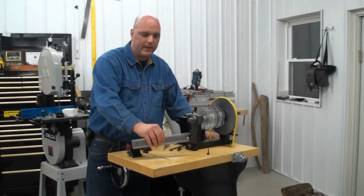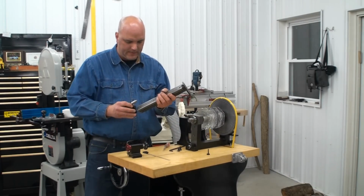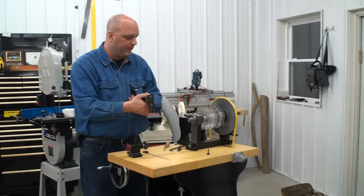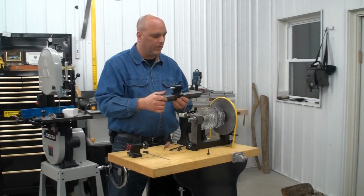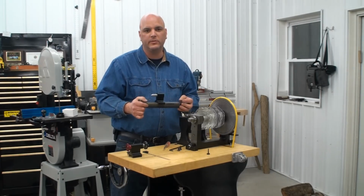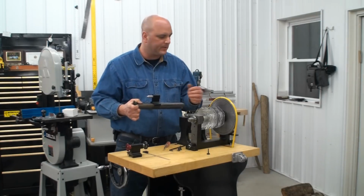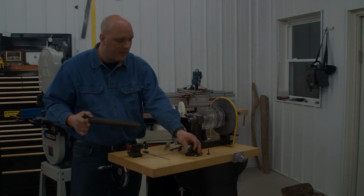Another function of the device is if you put the spring in the tailstock and you mount it to the rear of the machine, you can also use it for pumping in the opposite direction. Many times, especially in fixed tool work, you're going to want to pump the opposite direction as the pumping system we have set up now. So it gives you a lot more versatility.